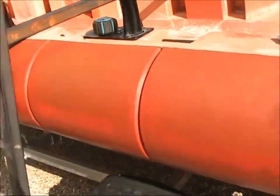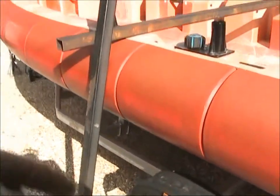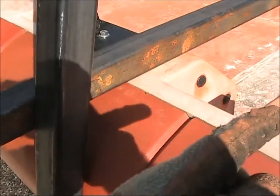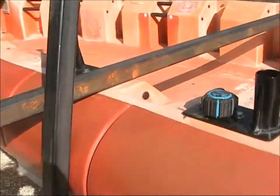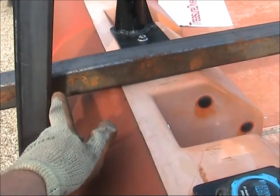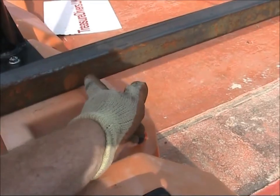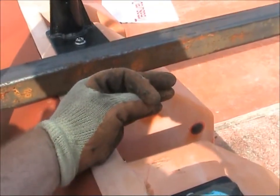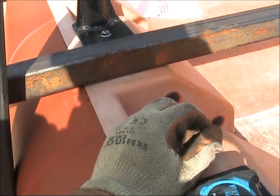So this is the look — it's basically just going to be an eight-foot piece of box with rungs in it. I'm going to drill holes all the way through and push a bar through, so the bar is sticking out both sides, then weld it up. I've got to weld this piece at an angle onto here — butt weld it — and then we're going to make some kind of receiver for it just to slot into, slide in, and then put a pin through it. Simple.